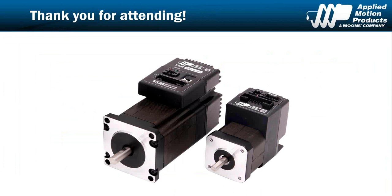Got one question about additional system accessories. What power supplies do you have available? We offer 24 and 48 volt power supplies on our website that are specifically for use with these integrated steppers, as well as our other standalone drives and motors. We also offer planetary gear heads for all of our motors. So we have NEMA 17, NEMA 23 planetary gear heads that fit right on the front of the motors, if you really want to increase the torque of the axis.